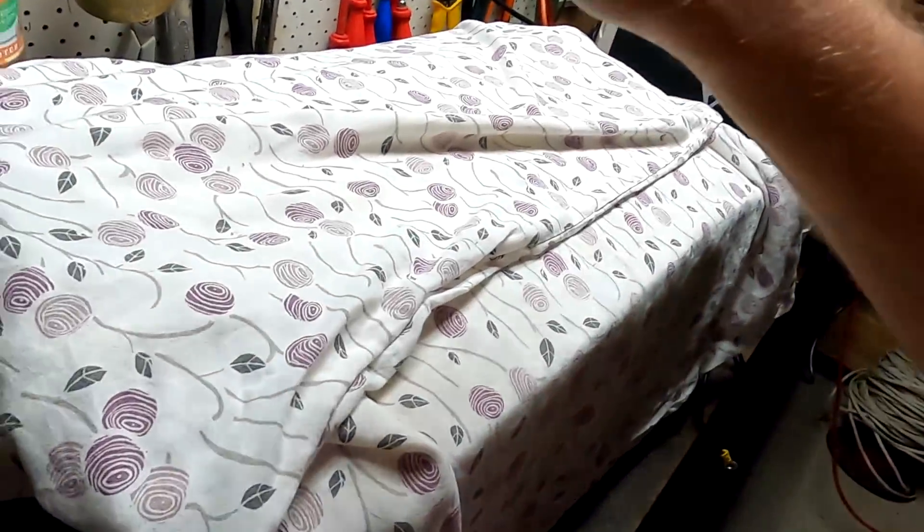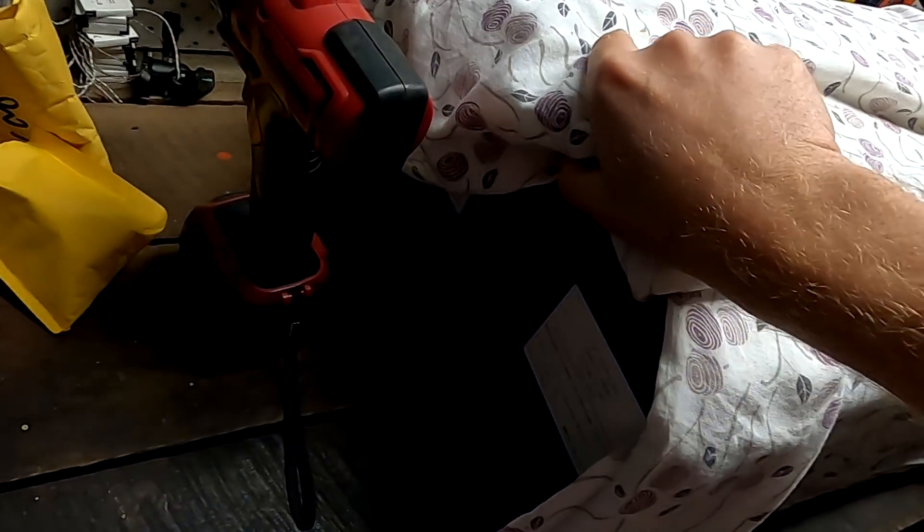Welcome to another episode — it's a late night show, it's actually a bit of a mess. Since two days ago I wanted to test our new 16S battery. I have everything set up ready to go to test our new BMS. I started charging this battery here with our power supply at 54 volts, 5 amps, came back an hour later and the current was on zero. I said, oh the battery is already charged — not bad.